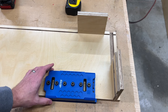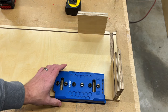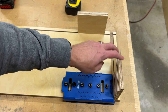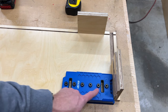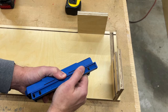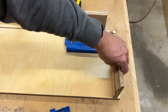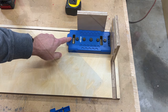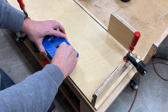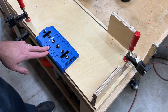Before I do any assembly I want to go ahead and drill all the adjustable shelf pin holes in all the sides of the cabinets. I picked up this Kreg jig — should make it pretty easy. For the front of the cabinet I'm going to use the included fence and reference that on the front, then reference against this scrap piece at the bottom. I'll probably start with this first hole. For the back run I'll take the fence off and reference against this other piece, starting in this hole. Once I've got the first hole drilled I can use this referencing pin to align the jig and the rest of the holes will be equally spaced.